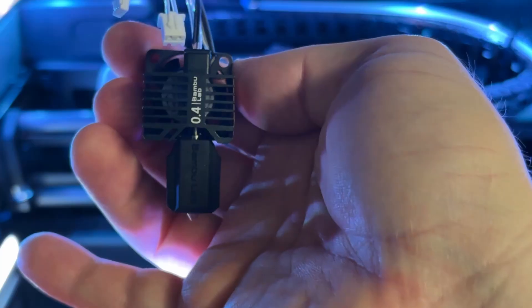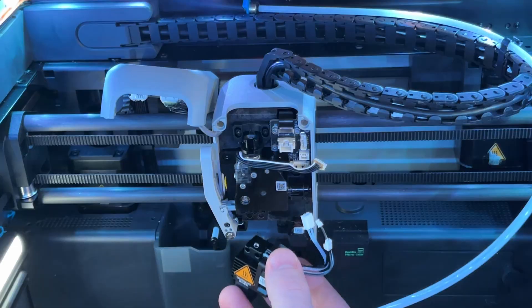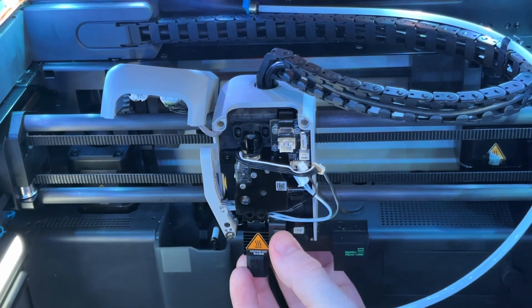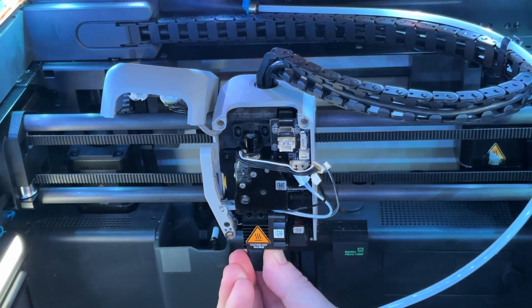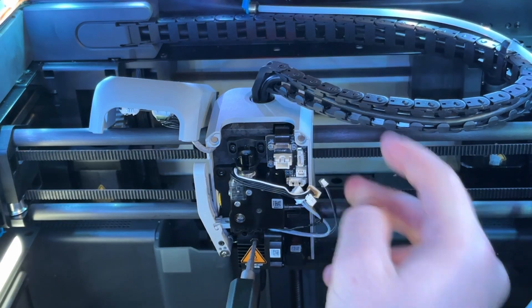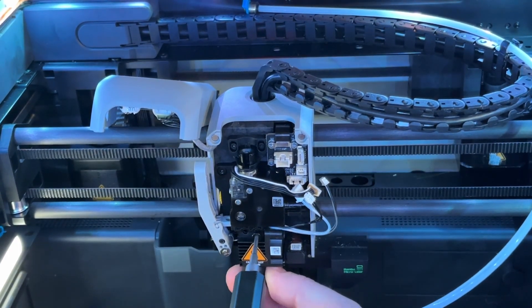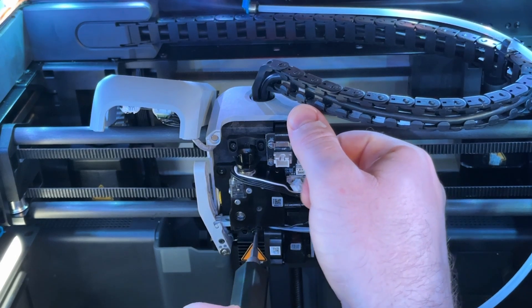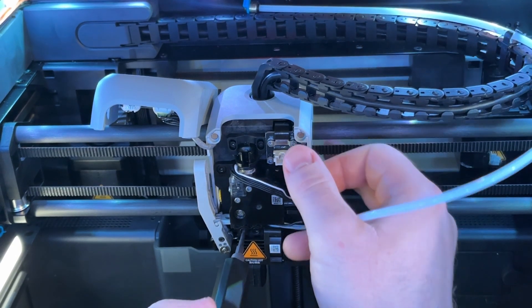While I'm here, I'm also going to install a new hot end assembly, which is quite a straightforward process. All we need to do is make sure the cables are not pinching on anything, then simply push it up into place and drive in the two screws that hold in the hot end. Sometimes it does require a little wiggling to get that first screw in, and then the second screw is usually much easier.